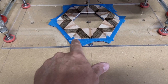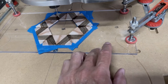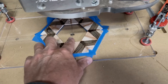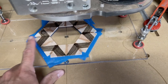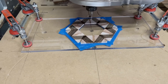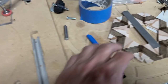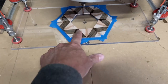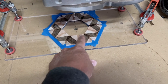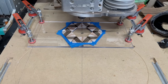I have the rosette blank super glued and taped to a scrap piece of acrylic, and the reason is I want to be able to line everything up through the thing I'm taping it on. I just happen to have some acrylic hanging out, so I've got everything zeroed up and I think it's pretty darn close. I have three rosettes that I made. I did put some tabs into the program so I'm hoping that really thin piece I won't lose. I'm nervous, I'm not going to lie — but we're going to hit the cycle start button and see what happens.